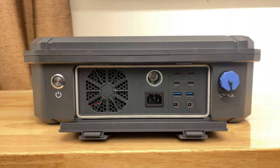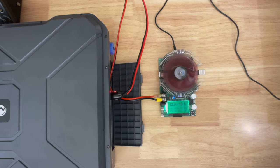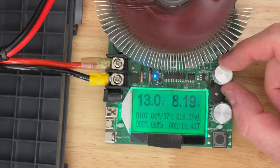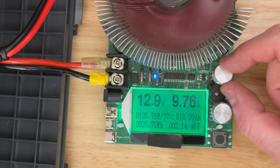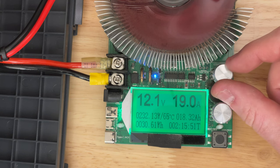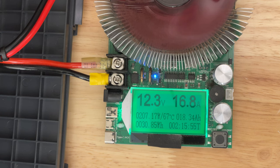DC output port testing. This reflects Montech's different design philosophy — as many DC ports as possible. The 12V cigarette lighter socket is a 20-amp rated port, versus the typical 8-10 amps. It sits at 13.6V resting, 13V at 8 amps, 12.9V at 10 amps, and I got all the way up to 19 amps on my tester before backing off — my tester isn't rated for that much power. Definitely a 20-amp port.